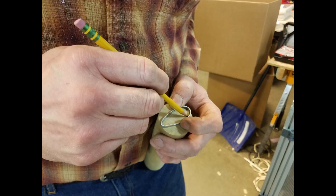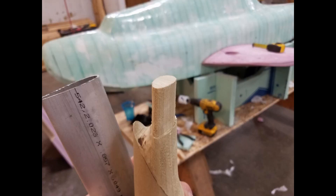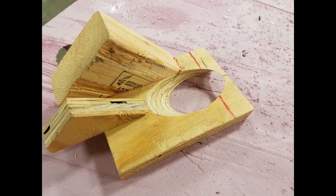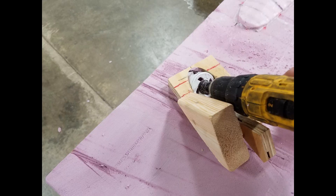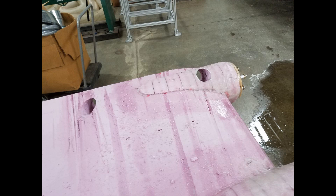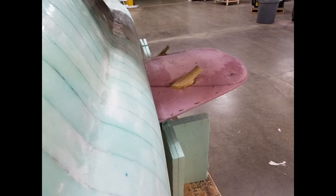Rod used a piece of the actual strut material as a guide. He marked the end of the wooden anchors for the strut, then fashioned them and fit them into the actual steel spar. The anchor points could be machined into the end of the wing using this drill jig and a hole saw, then epoxied in as well as the strut itself.